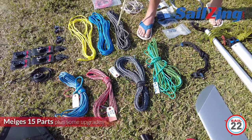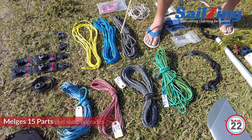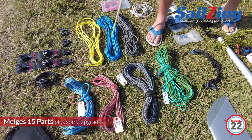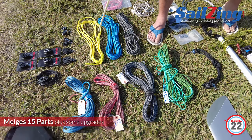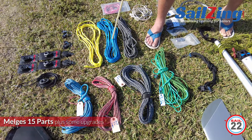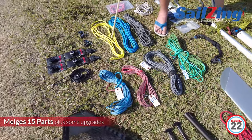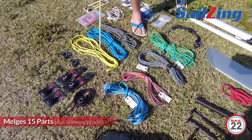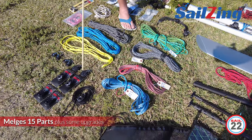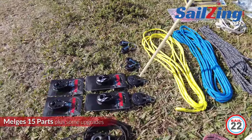But these would be your options that come with the boat. Similar main sheet, but polyester core, not tapered. Polyester core with a polyester cover for your spin sheets and jib sheets as well, and you have to tie knots. The knots become an issue with jibing the spinnaker, and with attaching the sheets to the cars. Block wise, Ratchamatic Seldens come with the boat, and they come for the spin and the jib.